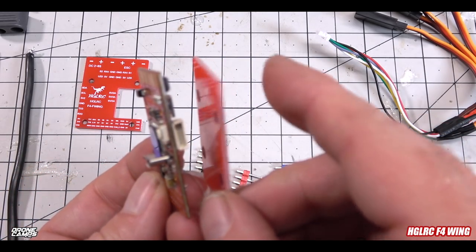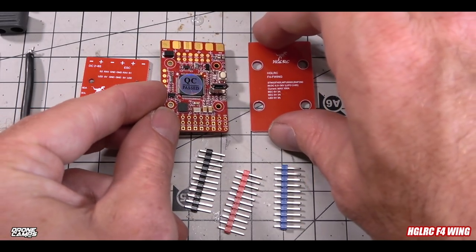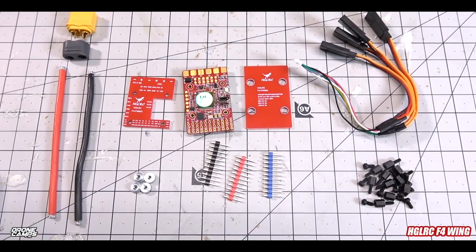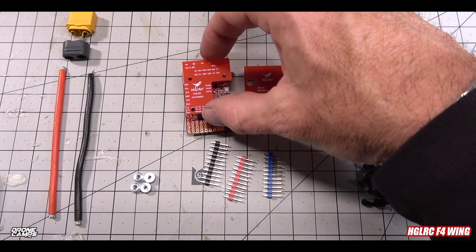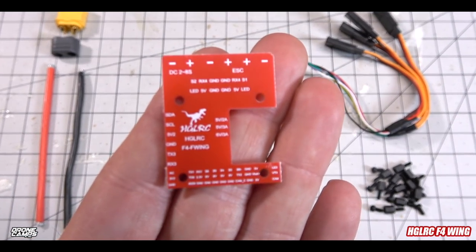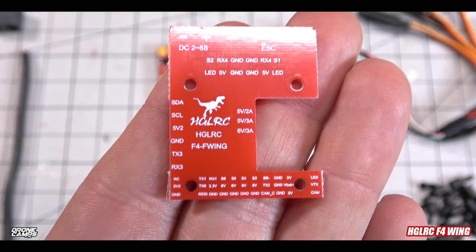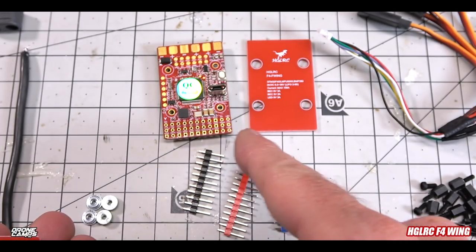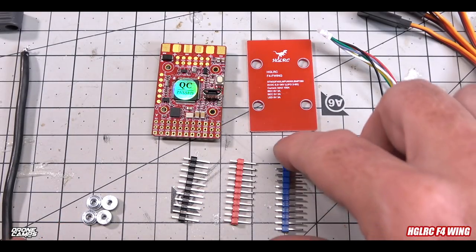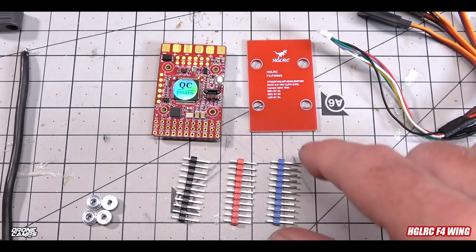You can even do a V-tail setup. You also get a base that mounts the board so you can secure it with VHB tape. There are plenty of standoffs and a top plate that protects the board and provides a quick-reference guide for wiring. They also give you pins — ground, power strip, and signal in blue — so you can unplug and replug components easily.